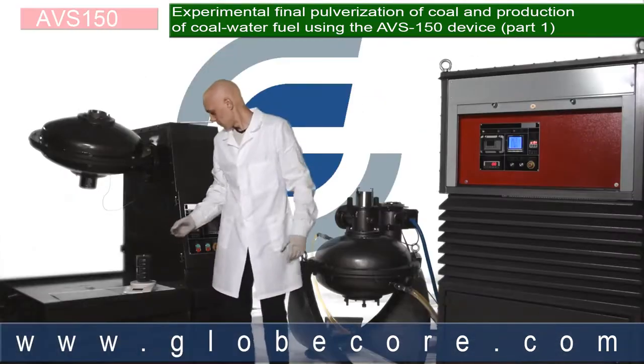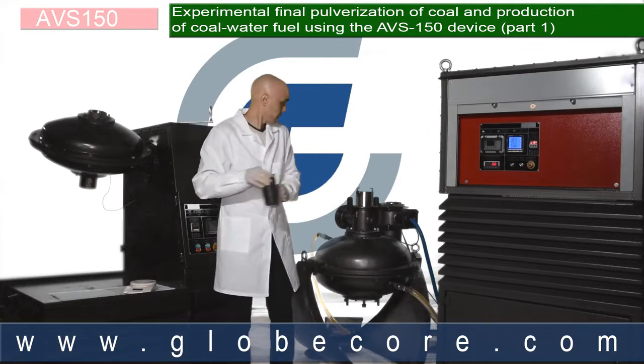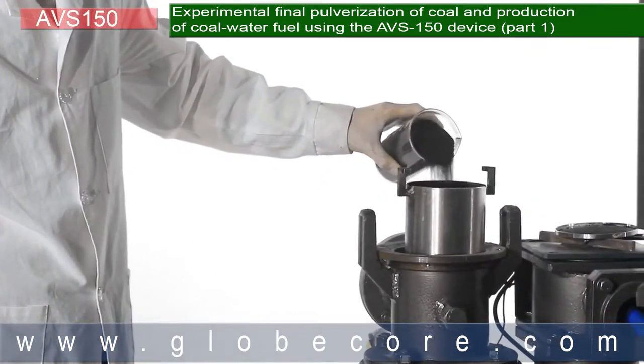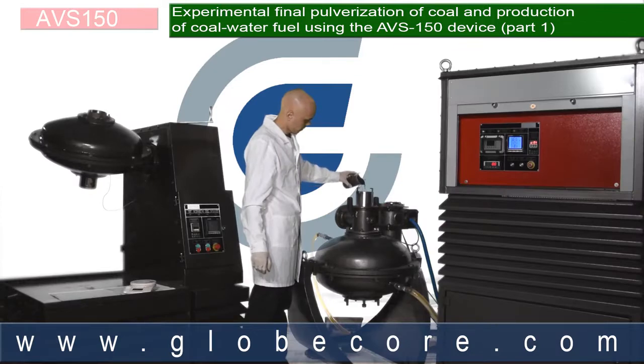The main principle of making coal water fuel is consistent pulverization of coal with specified parameters and precise dosing of additives to improve rheological properties and combustion stability.